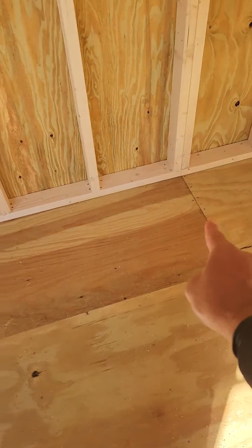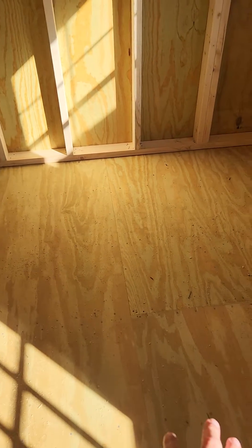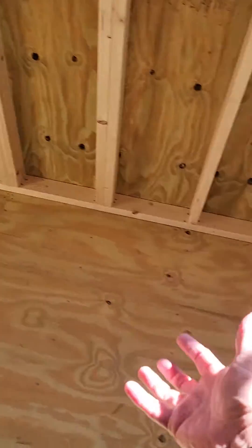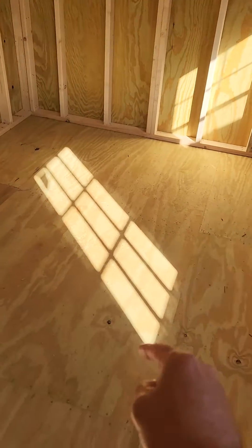Flooring is 5/8 inch plywood, pressure treated, and all of the plywood slabs are interlocked with each other using tongue and groove. When you're shopping around, find out if others build their floors with plywood — they probably don't — and ask if they use tongue and groove to interlock their slabs. Tongue and groove is the only thing you want. If they don't use it, you should walk away. Tongue and groove means each slab is interlocked, so if one slab tries to pull apart, it can't — the others hold it together. Without tongue and groove, one slab can pull apart and that's very difficult to replace.